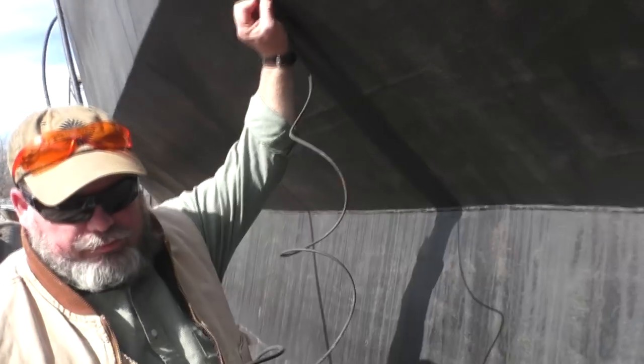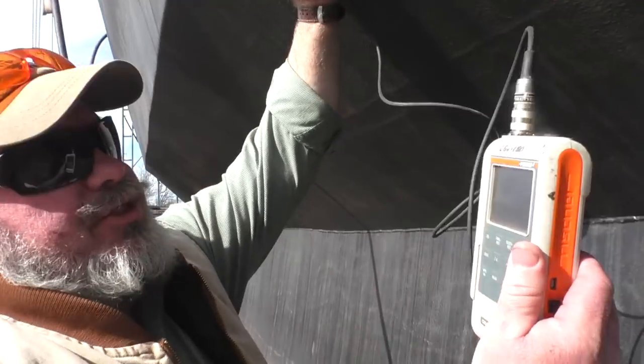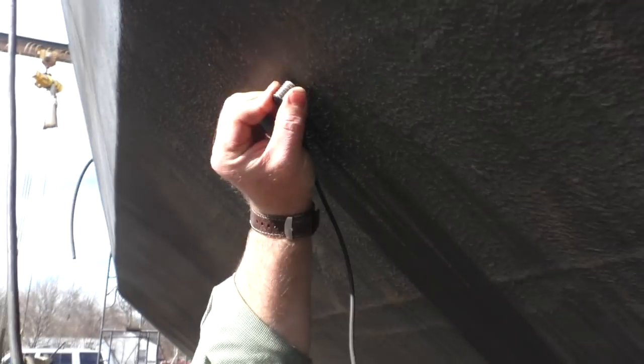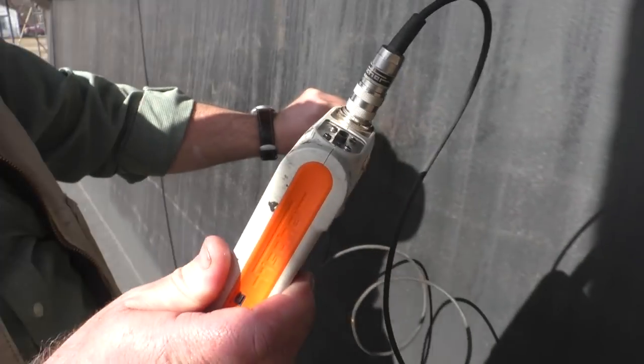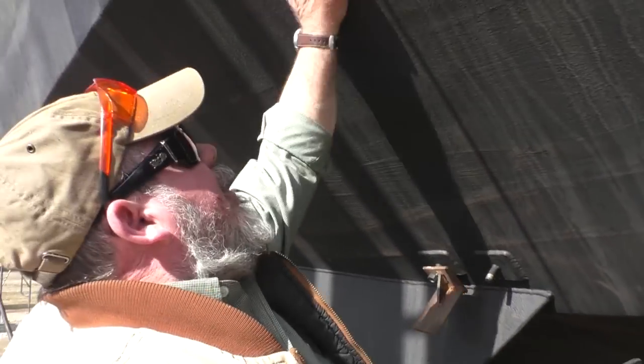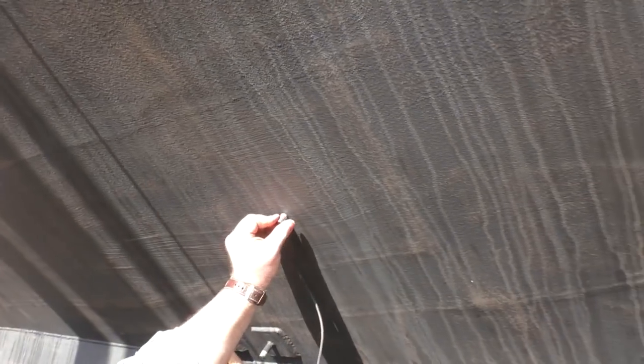Well, let's go around and do a few more and just see how thin we actually get. So that's a reading of 23.5 at that spot. If I move over the diameter of the transducer, 24.6 — and move again — 24.0. That I shot twice because it's a weld joint. 47.3. Yeah, I expect that because I came over here and shot the welds all separate just to make sure. You've got a fairly uniform coating. That's the sprayer.